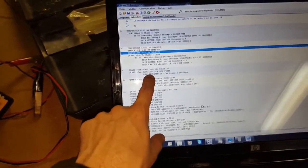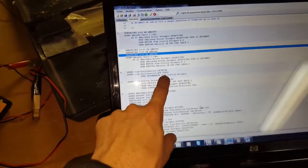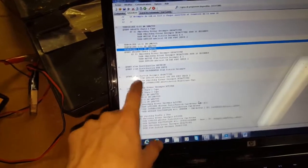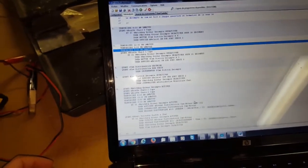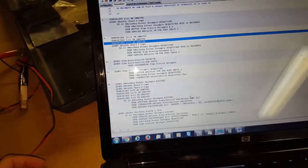Once the count reaches zero, it's going to stop and send the command to the RS-485 relay to stop the motor. There's also a watchdog that verifies the command has been executed. If commands are not executed, we're going to receive an email saying to verify either the motor, the cam, or the battery.